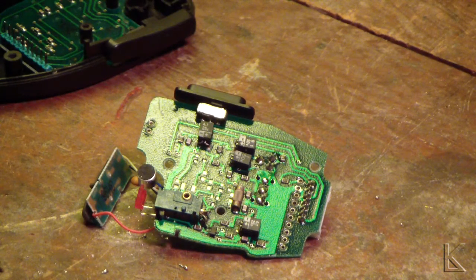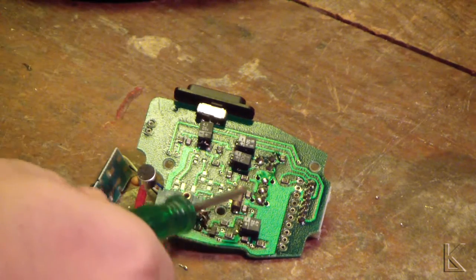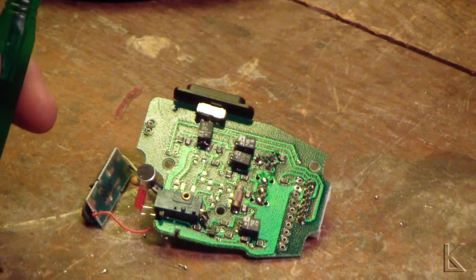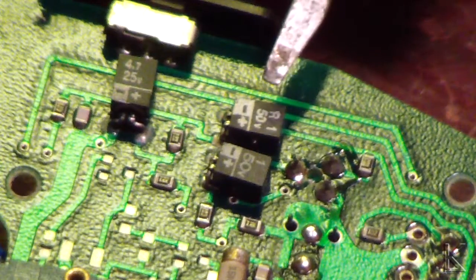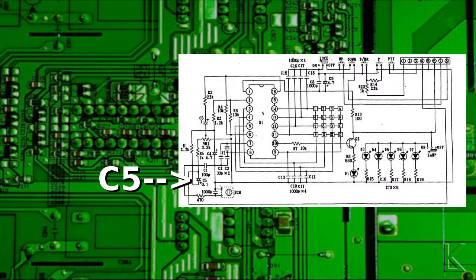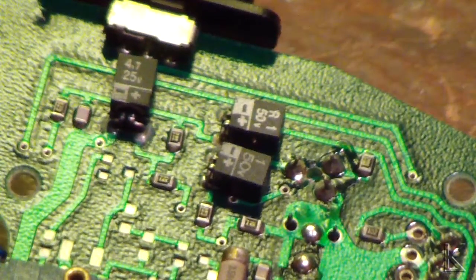Okay, here is the board — I've taken it off. There's the other underside board, you can see the pin headers. Flipped over, there are four electrolytic capacitors here. This one out here is the one we're concerned with. I'll pull up the schematic — this is C5, 0.1 microfarads at 50 volts, and that is the one that passes audio from the microphone element. That is probably our problem. As you can see from the tip of this screwdriver, this is a tiny little capacitor.